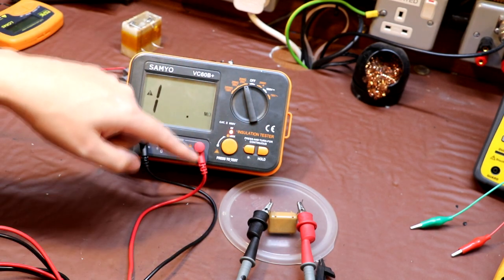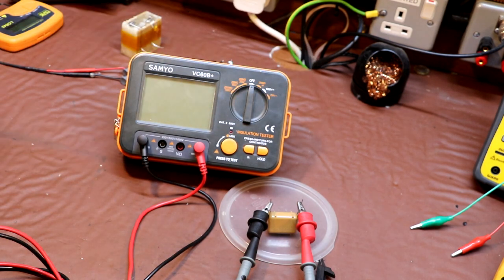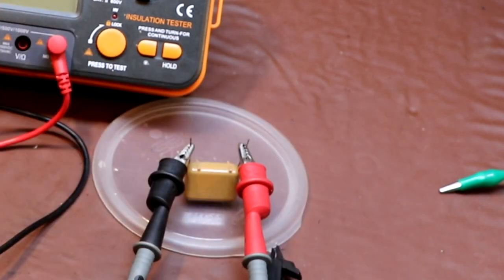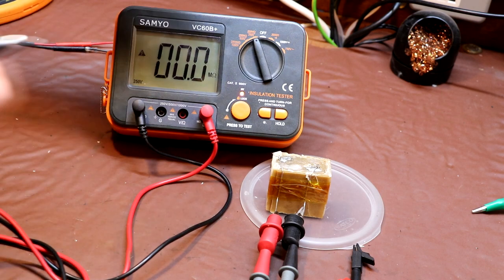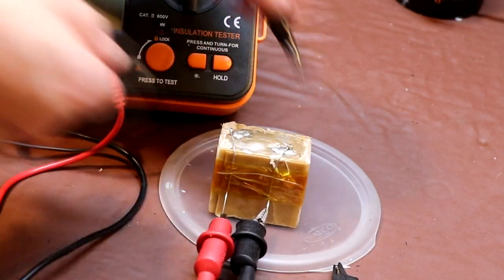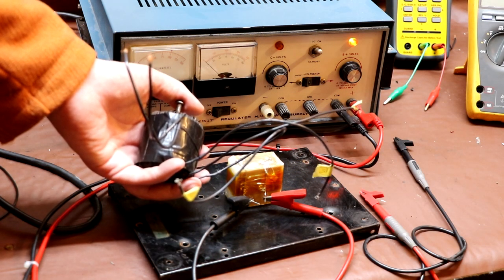Got to be a bit careful now because this capacitor has got 250 volts across it. So let's turn that off. Better just short that out, probably with a bit of a crack. There we go, discharge that. Charging. Clear. No, not a sausage.